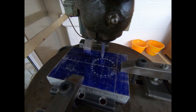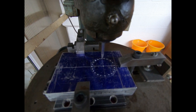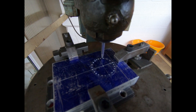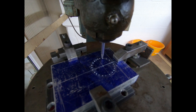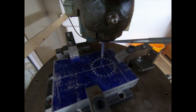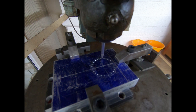What it has highlighted is that my center pop marks are pretty rubbish, so we may have to do a bit of tweaking. Bearing in mind we're just trying to get rid of the metal so we can do some filing. What I'm going to do is move this upwards, swap and put the drill in, and then we'll do some drilling.